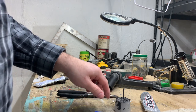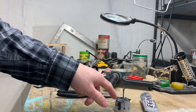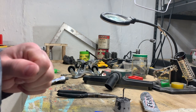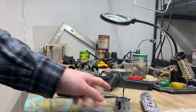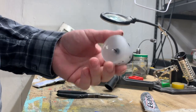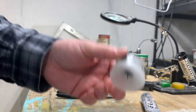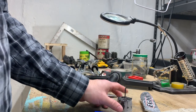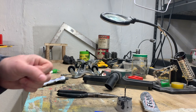It's only cured on the outside. The inside is not cured. It could be because of a lack of oxygen exposure. This stuff cures when exposed to oxygen, so it might be too thick. I'm glad this happened. Again, it's not over yet. I mean, this could still be fine, probably in another 8 hours or so. But there's a lesson to be learned here.